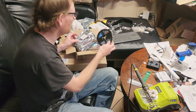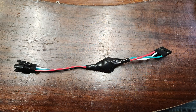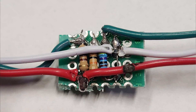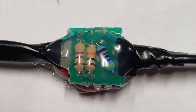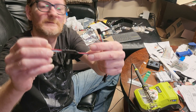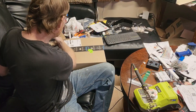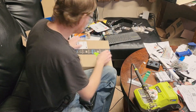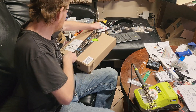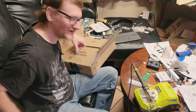If you're getting random flashes of light on your LED strip, it's possible that 3.3 volts is not quite enough to drive the LED strip correctly, especially if you've got any kind of wire run. My first variation — this is the Pi version again — is just a tiny piece of circuit board with an LM393 and a handful of resistors. Works like a charm, but that's kind of hard to sell. This I think might sell a little better. One of the things I've been waiting on — tell me it didn't come in this giant box — yeah, it came in this giant box.